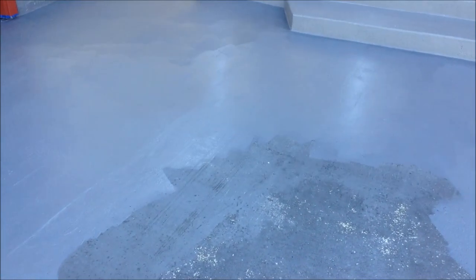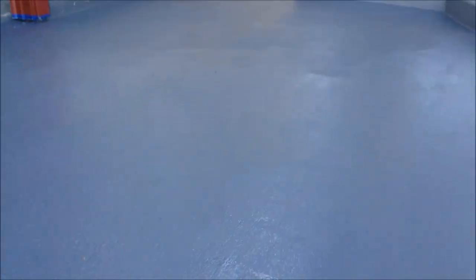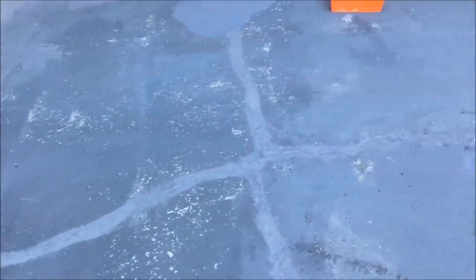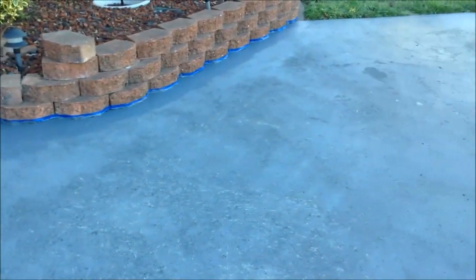Hey friends, we're painting the driveway here and I'm using the Behr Premium concrete and garage floor paint. It's kind of a gray color as you can see. I painted this part so far and I washed it off — I didn't use a pressure washer, just my hose. There are parts where the water stays. I sealed the cracks with some epoxy, and this is a one-part epoxy coating. I went around the edges on the porch and around the brick with a paintbrush.